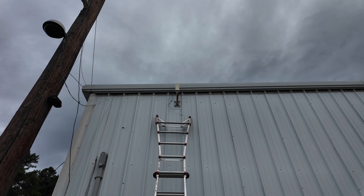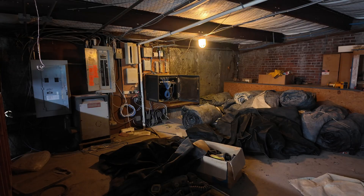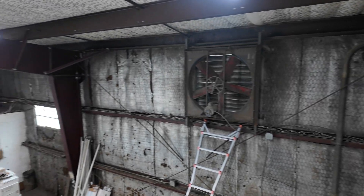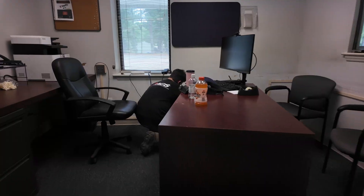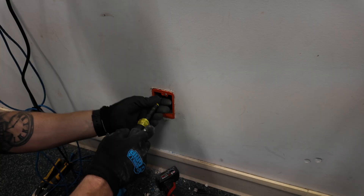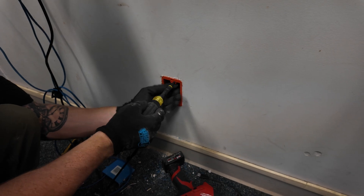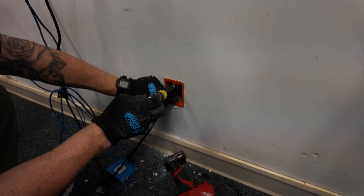We're going to reuse that old cable for the existing wireless unit as a pull string. We'll connect our outdoor cable to it and pull it through the building. There's the network cabinet here. We're routing the cable along this I-beam, and that's where the cable goes out of the building to the wireless unit. We put the sheetrock insert — had to cut the box out because the wire wouldn't go through it. We've got the wires coming out and we'll put a two-port faceplate on it, then use a patch cable to go to the switch.